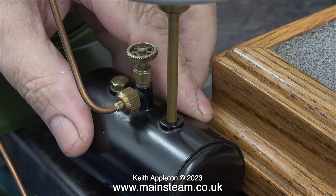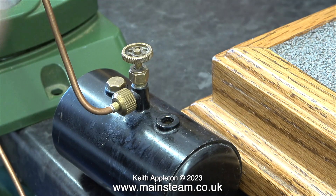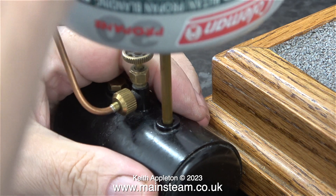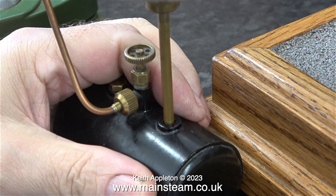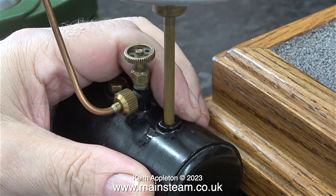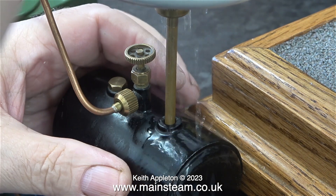Here's a good reason for not filling the gas tank indoors — watch this. This gas tank adapter is very poor and it doesn't seal against the canister. When I press the pipe into the gas tank, which opens the valve inside the canister, the gas goes everywhere. It's liquid gas and it's very cold and very smelly.